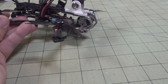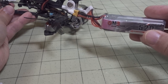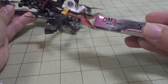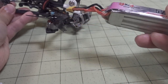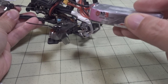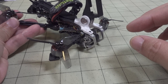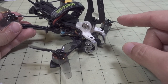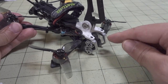If you want a more efficient flight — longer flight with less acro — then go with the lower-pitch 1.8 prop. I wanted to do a little bit of freestyle with the higher-pitch one to see what it was like. I think I would probably go with a heavier battery than the 520. With the PID tune they have on here, they probably tuned it for a battery that puts you right at 250 grams or maybe just a little bit under, because the tune did feel a little loose based on the weight. Maybe instead of the 520, go for a 650. They should include guidance on the website about what battery weight to use for the PID tune — on smaller drones, a difference of 10–20 grams makes a pretty big difference.